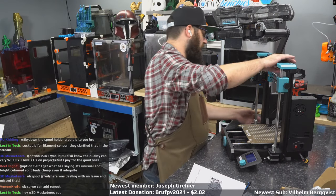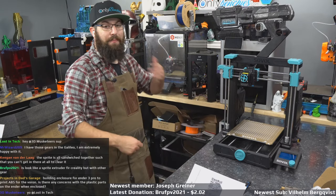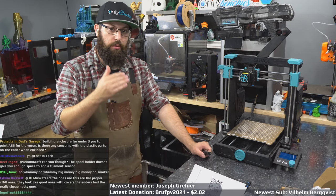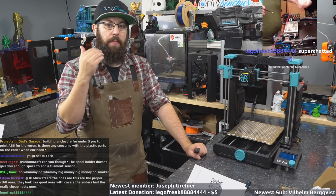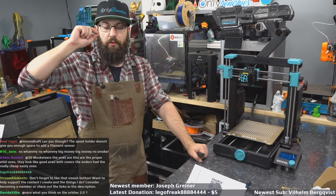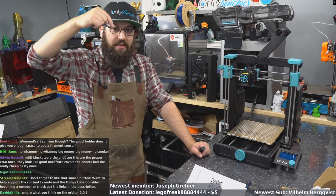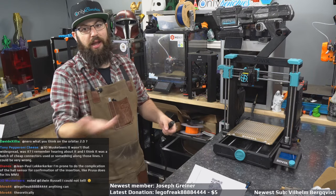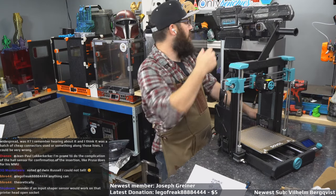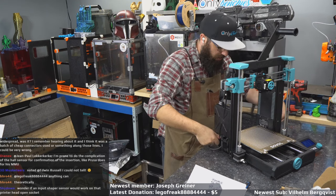No one seems to do it. So the problem with runout sensors, with Klipper for example, is that because Klipper sends batched commands to the controller board, you cannot actually have a runout sensor right above your extruder. What'll happen is it'll run out and send the signal, but you have to wait for the next batch of commands to be sent to the MCU. So if it's right above the extruder, like on a Prusa, depending on what movement it was doing, like a really long straight line, it could actually extrude past your extruder gears, and then it gets a signal to pause, and it's too late. It's already fed in past the extruder gear and you have to take it apart to get it out. So with Klipper, it's better to have it up by the spool holder. That's where I do it when I play around with it, but I don't play around with it too often.